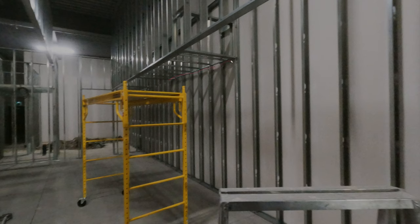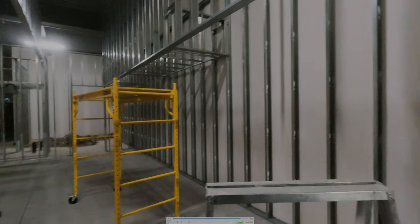You see here we have angle — this is just angle and furring bar drywall ceilings — and that is acting as the bracing for this front bulkhead. The T-bar is going to finish across flush from this bulkhead into this bulkhead, and the elevation is going to be perfect. We have this big reveal here — this is where the hood fan goes and this is where the pop machines go in here. You've got to be exact with these measurements, especially when you're doing a restaurant. The food equipment comes and you've got to make sure it fits.